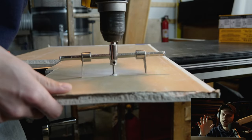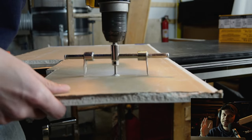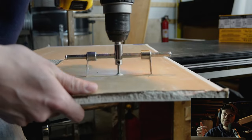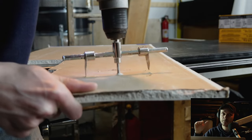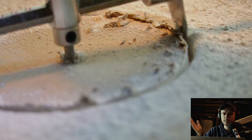This is the important part: you want to make sure that your drill is nice and level — or rather, perpendicular to the face of the drywall. If you're crooked at all, your blades are going to cut through one side faster than the other and you're going to puncture that finished paper face, and we don't want to do that. We're really just trying to cut through the back paper and the gypsum core. You want to get as close to the front paper face of the drywall as you can. Be very careful — don't be afraid to go slow.